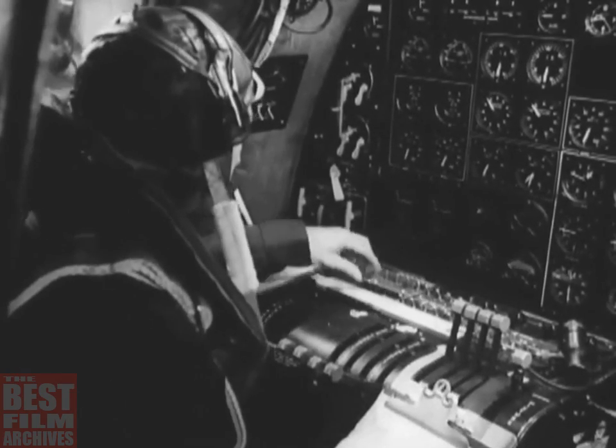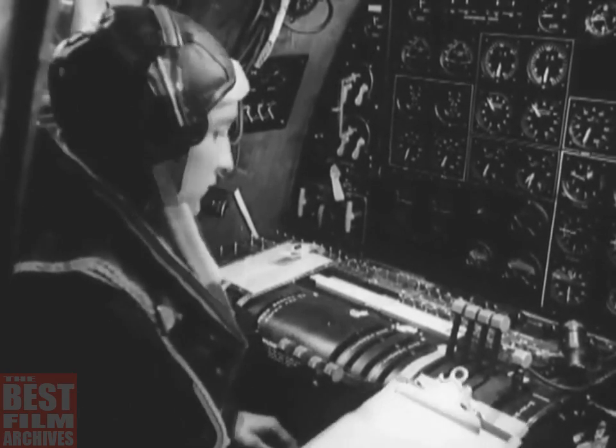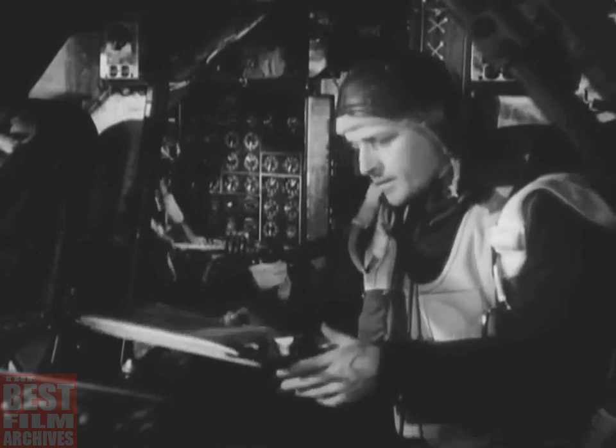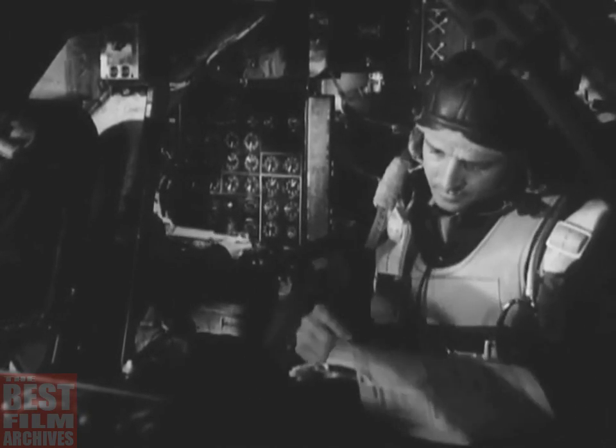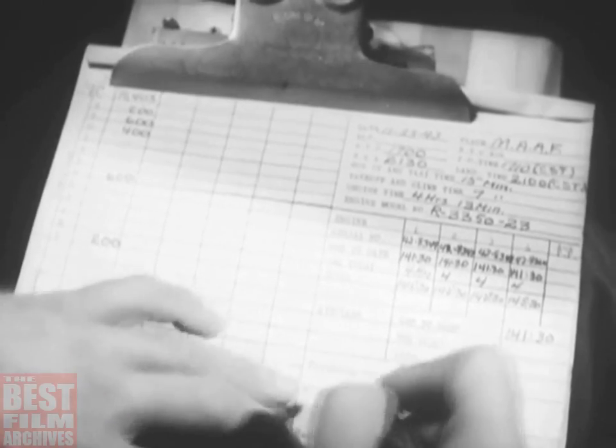Ask the engineer for forms 1, 1A, and 01-1-40, and look them over. Be sure that everything on forms 1 and 1A has been checked. Pay particular attention to the list of defective equipment. If anything vital is out of order, it must be fixed before taking off. The weight and balance computation is in form 01-1-40. That's important. Make sure it's correct.